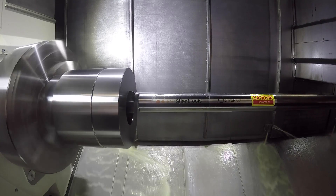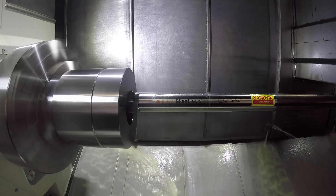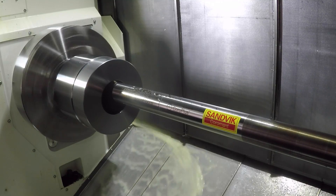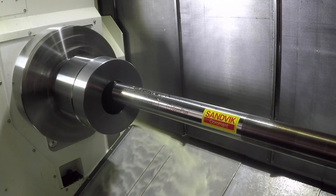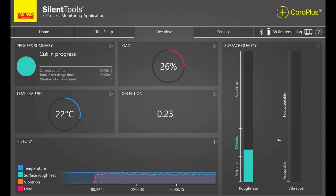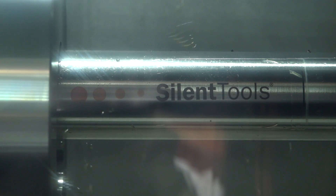The tool is set and we're actually now in cut. So what's taking place? Right now we're machining a semi-finishing cut — 2mm radial depth of cut and 0.25mm feed. As we can see from the sensors streaming via Bluetooth, we can see that we're in cut. This might seem obvious, but for a big long bar inside a closed-door machine with coolant doing small cuts, you don't really know if you're machining air or not. We can see a very steady load at about 25–26% of the maximum of the bar.